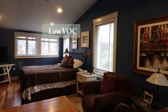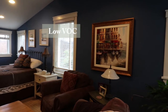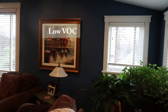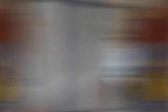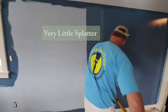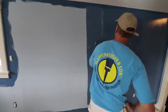This C2 matte finish is a low VOC paint. I had the windows cracked and there was still a smell of paint in the air. My daughter came over about two hours after I was done painting and said she could smell that I had painted. So there is a lingering effect with the odor, but it was very moderate. The splatter of the paint was minimal — there were some blue splatters on the baseboard, but nothing to get too excited about, especially since I was going to paint the baseboard anyway. Just use some drop cloths and you'll be fine.